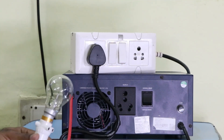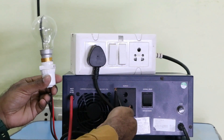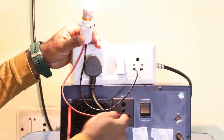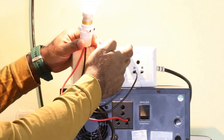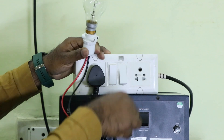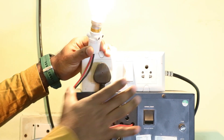It depends on you whether you want to take the output power supply through two wires or through a single wire. In this way, we took the phase wire from the output terminal and the neutral supply from the charging input — and our bulb glows. Connecting two wires also makes the bulb glow. This concept of inverter wiring with single wire or two wires should now be clear.